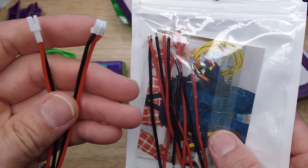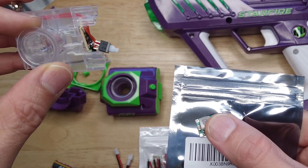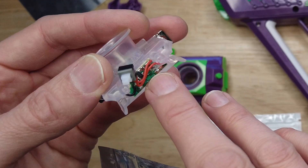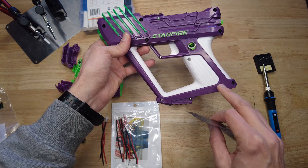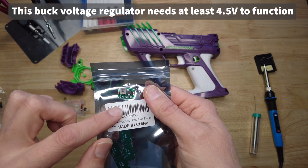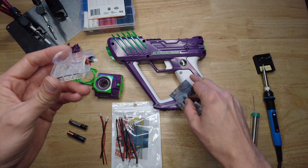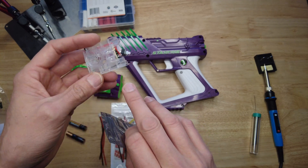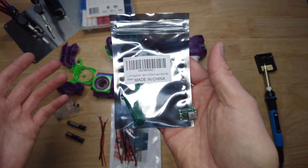To do this mod you're gonna need some kind of connectors like these JST PH2 connectors — these work perfect. You're going to need a 3 volt voltage regulator; this one is 3.3 volts. The UV LEDs are typically rated about 3.2 volts and this is designed to work with two double A's which is 3 volts, and since it also has an onboard voltage regulator it can handle a little bit more than 3 volts, but it can't handle the 5 volts coming out of the front of this blaster or the 7.4 volts from the battery. This voltage regulator will drop any voltage higher than 3.3 volts down to 3.3 volts. It's not as simple as just using a resistor to drop the voltage — you can use a resistor for a single LED, but here we have four LEDs and there's already a voltage regulator expecting a certain voltage input, so that's why you need a voltage regulator. These are extremely cheap, they don't cost much more than a dollar a piece.